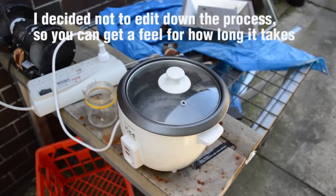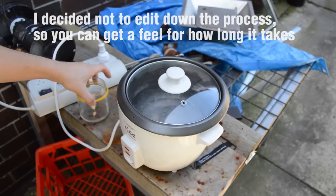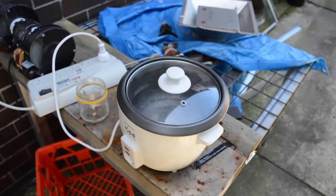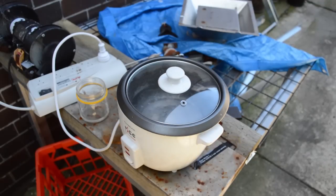Alright, so I've got my rice cooker preheating. I have my acetone — about 2 capfuls worth — and I have safety glasses because your eyes are extremely important. I have the other parts on their jig inside my workshop where it's cool, because it's a hot Australian day and if I bring them out here they'll heat up and the acetone won't condense on the surface very well. So that's slowly warming up — probably give it another 30 seconds.